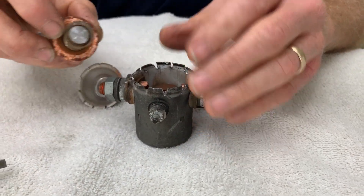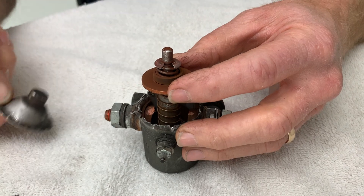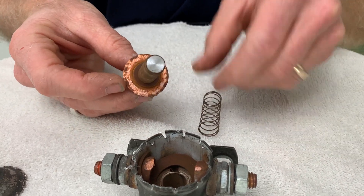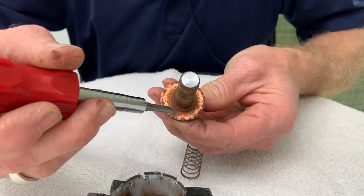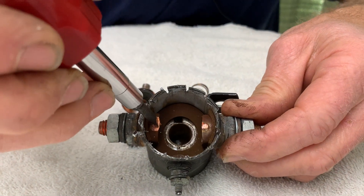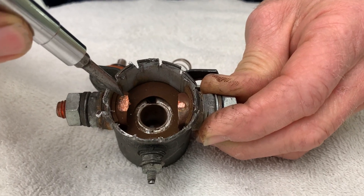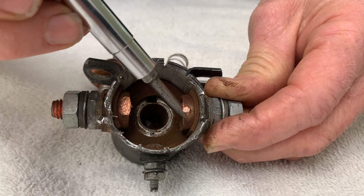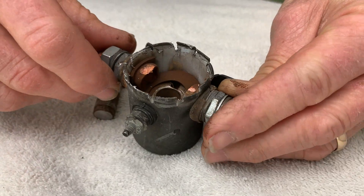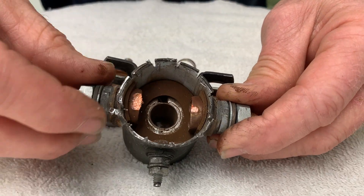Okay, so we can see here the inside portion of the electromagnet. There's the lid, and then down on the bottom here we can see that this copper ring is the contact area that joins one side to the other side. We can see here that this area was making pretty good contact. This one over here, you can tell there's only a very small spot that was making good contact, and that could have been a portion of why it was not allowing the current to flow freely across there.